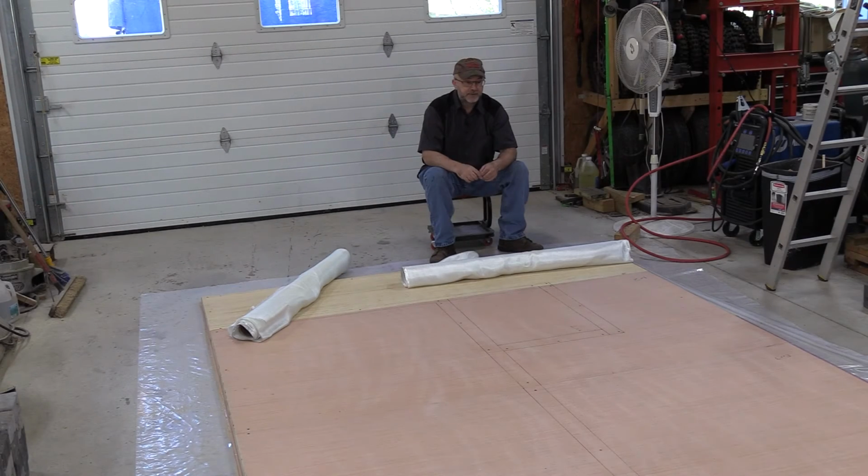So last night, after the resin had time to set up, I came out and hit this with some 60 grit sandpaper to give it just a little better tooth for the resin to bite into. I also hit the front edge of the wall, and the bottom, with a router with a roundover bit to give it a little bit of a curve.